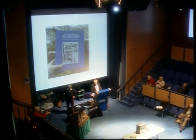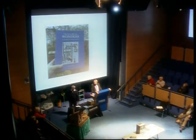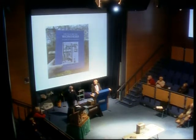And looking at the wonderful machine you've got for modelling the bricks. You're cutting off. Is that cutting? Are you firing the bricks after you've cut them like that, or how are you making the bricks? The bricks are made from dry powdered clay. The press presses four each time. To press four bricks at a 16th full size, it needs 5.5 tons of compression for the firing to be successful.